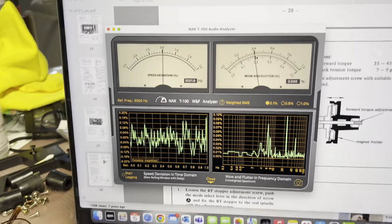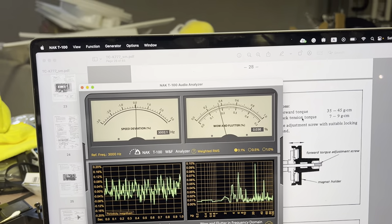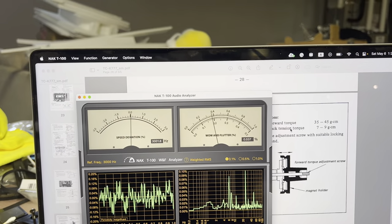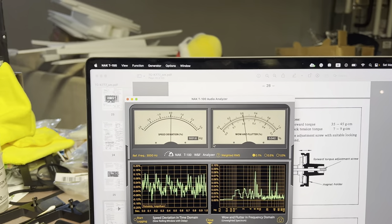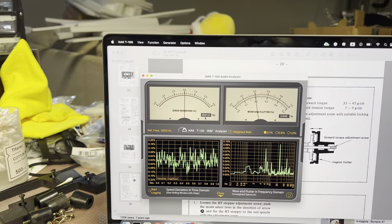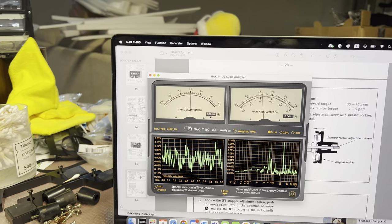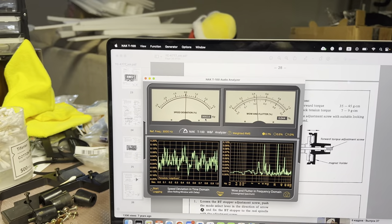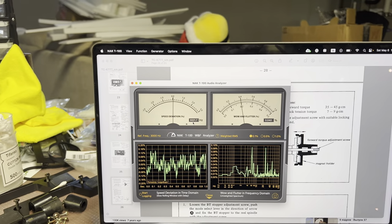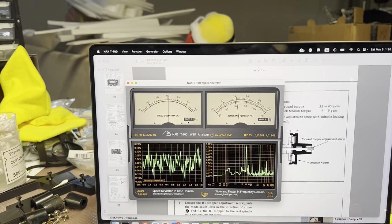This will have better rather than flatter wow and flutter - it still goes below 0.04 now. I had to adjust the supply side tension as well, and it was easy using the frequency counter. As soon as you're over-tight, the frequency starts to drop - it gets to 2995 hertz. So it's a job to find the proper position so it would not over-tighten and the supply side pinch roller would be able to pull tape smoothly.